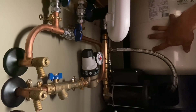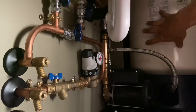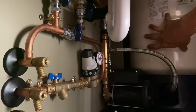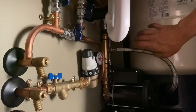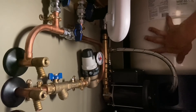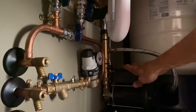Once filled, this vessel can give you a maximum pressure of 3.2 bar and a maximum flow rate of 16 liters per minute. But be careful: 16 liters is the max, meaning if you've got 12 liters from the mains, the vessel adds 4 extra. If you've only got 9 or 10 liters per minute, you're adding 4 liters onto that — so 13 or 14 liters per minute maximum. Once charged and you open a tap, you get up to 3.2 bar and 4 extra liters per minute for a maximum of 8 minutes until the vessel is depleted. After that you revert to mains flow with the pump's 1.5 bar pressure boost.